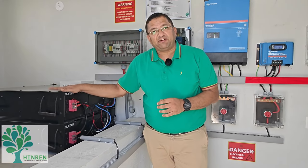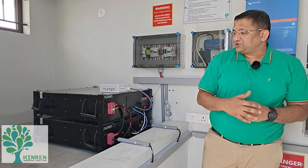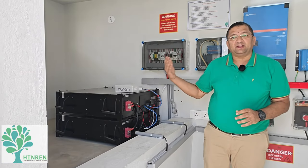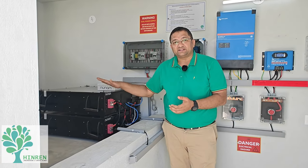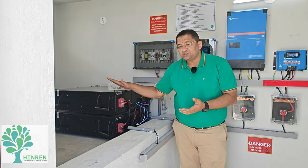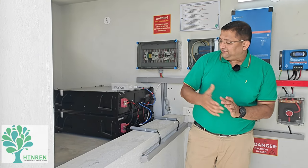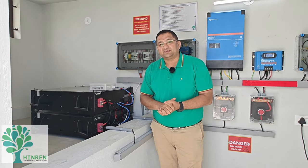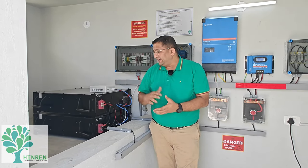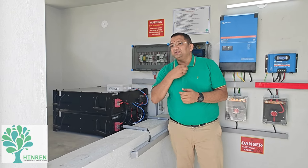Another feature of the system is this battery. Each battery is 5 kWh, from a company called Newnham. They upcycle batteries and convert them for solar applications. There are two batteries connected in parallel, each of 5 units, making a total of 10 kWh. This is a lithium-ion battery. We have a guest today — Nilesh from Newnham — who is going to explain the battery in detail and tell you about the exclusive features of the system.